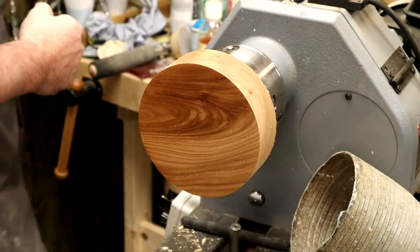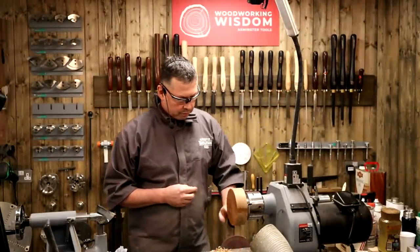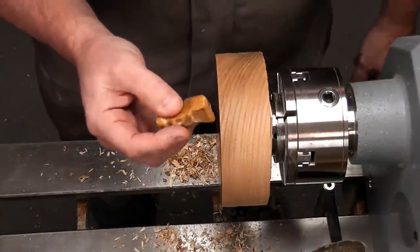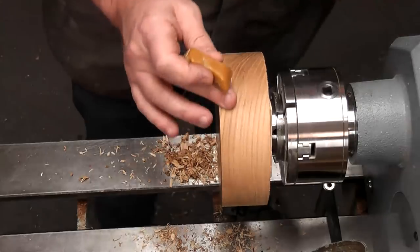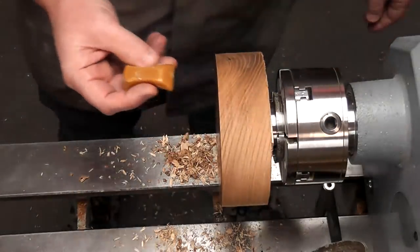But then once you've done your French polish, if you want that extra level of shine, Carnauba wax. This particular one is the Liberon Woodturner stick, which is a mixture between beeswax and Carnauba, but pure Carnauba, this Carnauba, Hampshire Sheen Carnauba, Chestnut Carnauba, they're all going to be brilliant at doing this job.